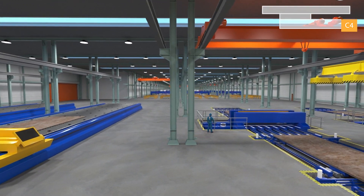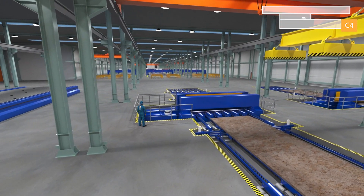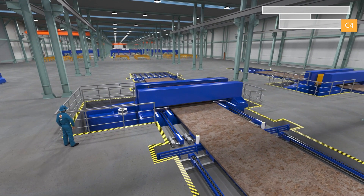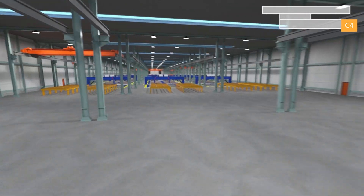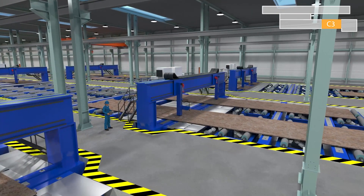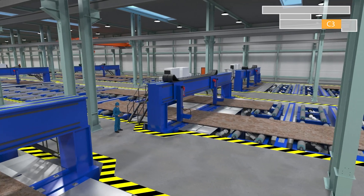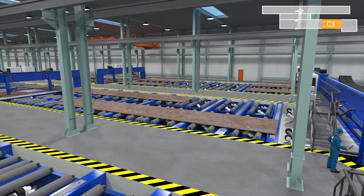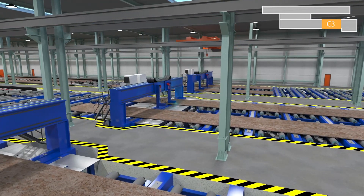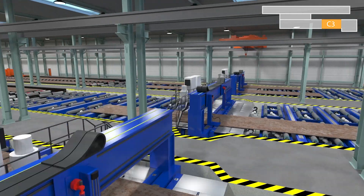Also here, the pre-cut plates for the cones and the plates for the cans will be milled on the shortest sides that are going to be welded together in the next part of Hall C. Here we have three identical assembly lines where the plates are fully welded from both top and bottom. This means we do not have to flip the plates to weld the other side. Less handling means this is safer and it drastically reduces the process time for this part of construction.